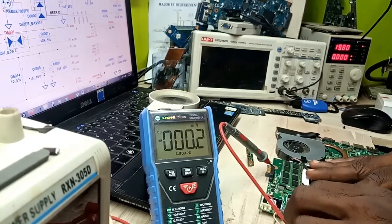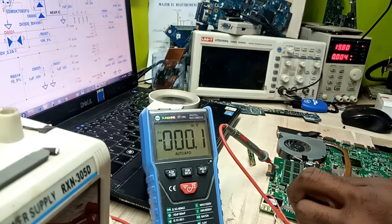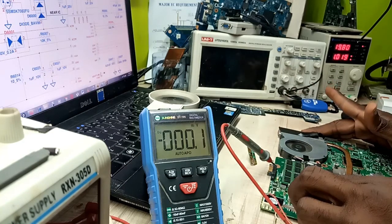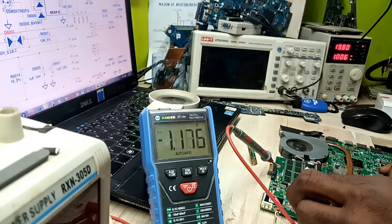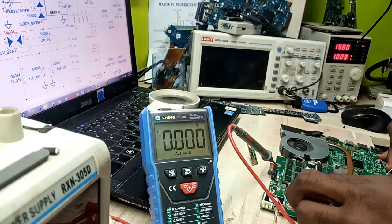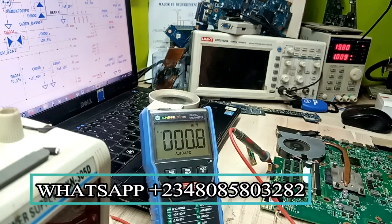Let me show the pin again and force power. Let me pull the pin — before it was drawing around 29mA. Now you can see the board is showing backlight or display activity, which means the display is now present. Checking voltages: 1.5V is present, 1.0V is present, 1.1V for CPU is present, 1.05V for PCH is present, and voltage for graphics is present. As you can see, my board is now working.